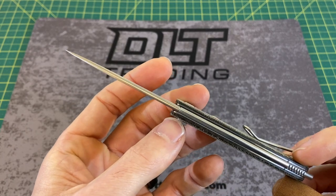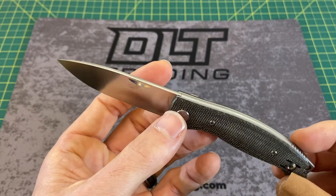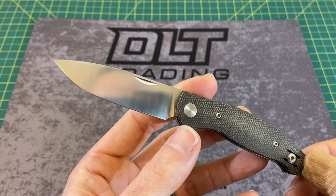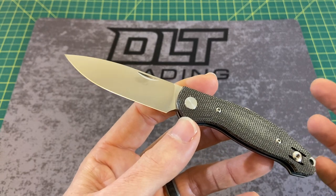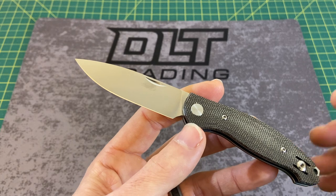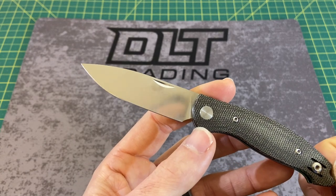And again, not a very thick stock, around 119, 120 thousandths. That's a slicey blade. It doesn't matter. I mean, would 13 thousandths maybe be a little slicier? Well, yeah, because it's thinner. That doesn't mean that 18 thousandths is a thick edge. You know, 18 thousandths is still a very slicey edge.